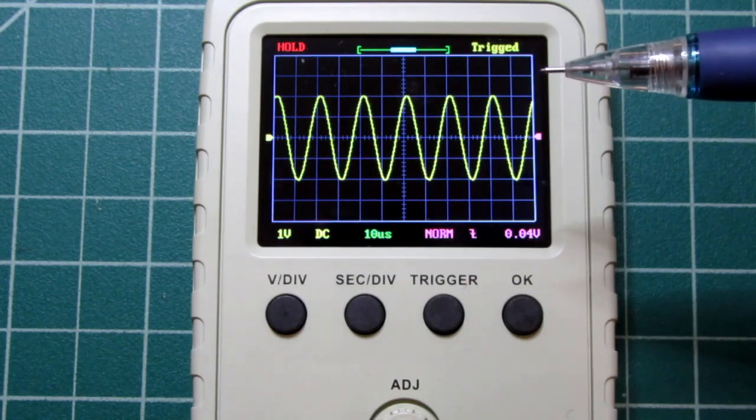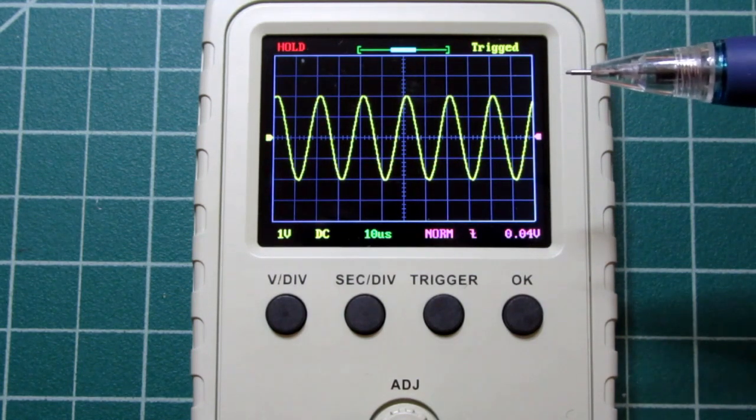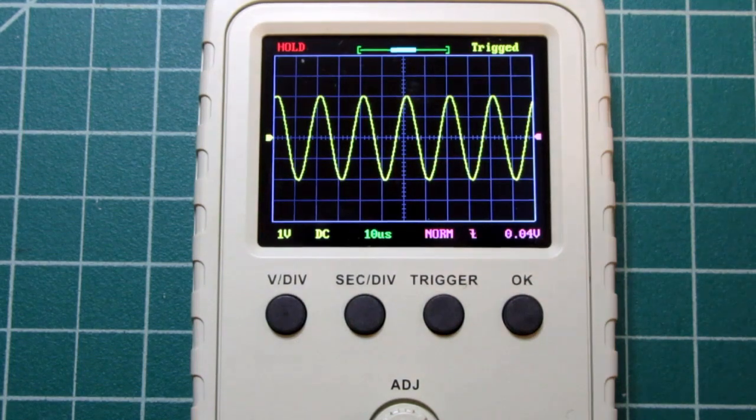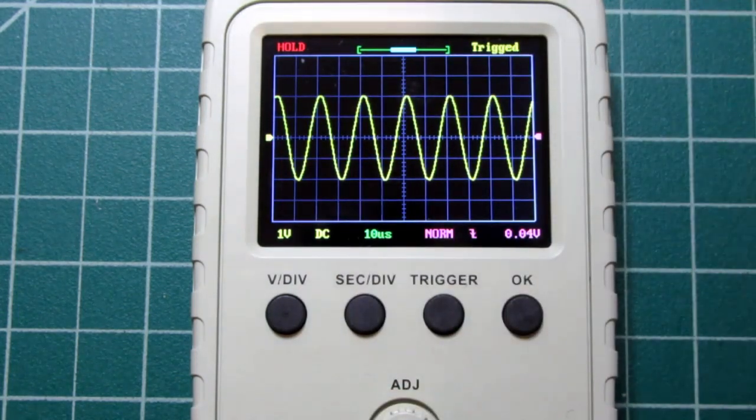Audio frequency range is what a lot of people are going to be using it for, frankly. It's probably not much good for monitoring almost any modern digital circuit, because frequencies will be much too high. You can't use it for radio type applications either. Also, this is not a shielded design — if you get this unit in proximity to any kind of RF frequency signal or field, it doesn't have any shielding and you'll get all sorts of weird stuff happening. This is really for a nice low-frequency ambient environment, such as an experimenter's desk where they're working on relatively low-frequency or audio-frequency range analog signals. For that it works just beautifully.